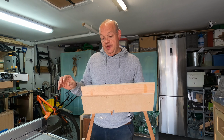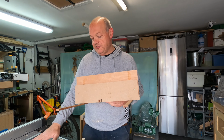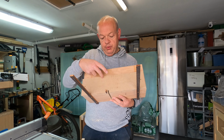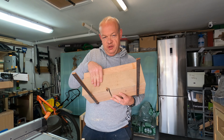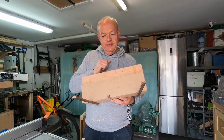And the other thing is, you do need some sort of clamp or some sort of system to hold the wood, because as the wood goes over the blade guard in particular, it has a tendency to move around a little bit, and obviously you can't put anything permanent there because each time you're moving it, it would need to move with it. So I think something perhaps that comes down from the top that slides along here, but I'll have a think and maybe make that modification.